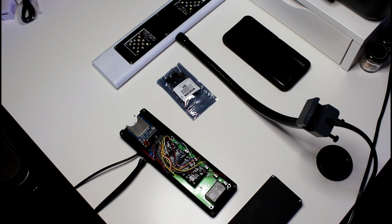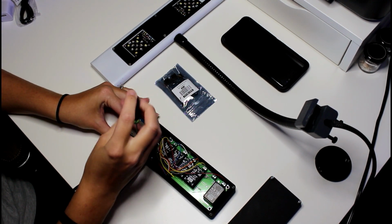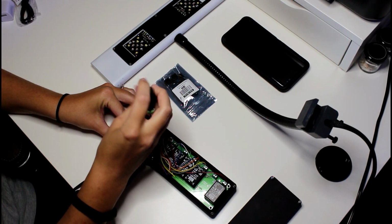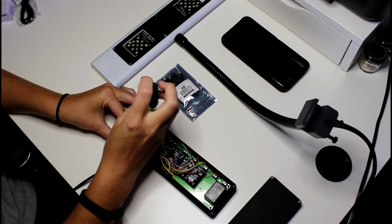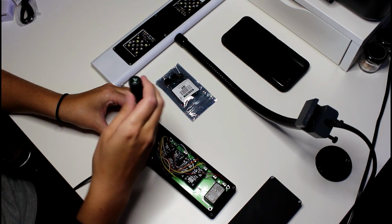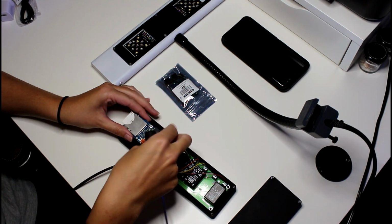Earlier, my husband used a multimeter to determine that power was going into the IMP card and Bluefish controller, but was not being diverted back out to power the lights on. To double check this, we did swap Bluefish cards between the two fixtures that I have. Sure enough, the Bluefish from my Tide worked in the Duo.